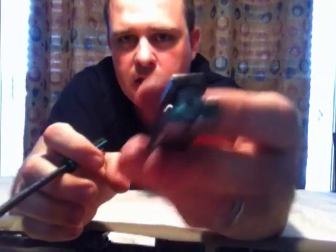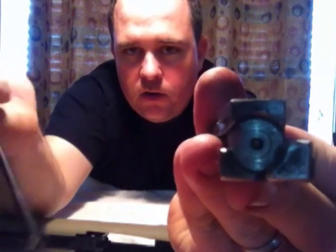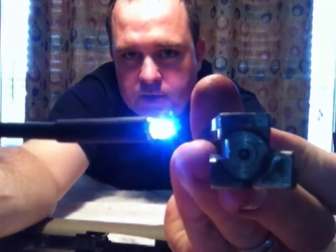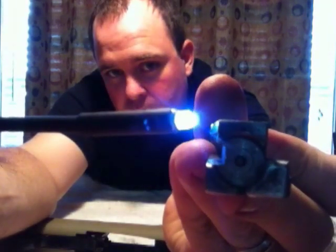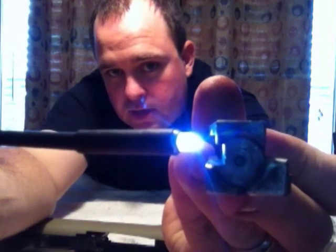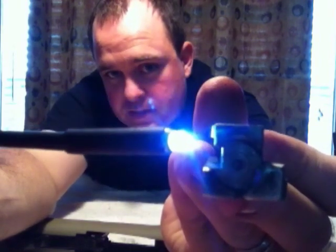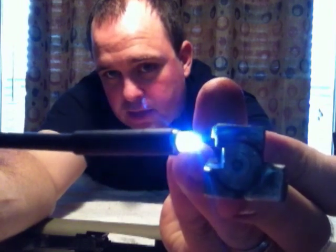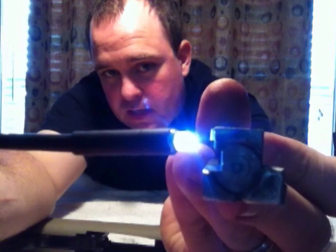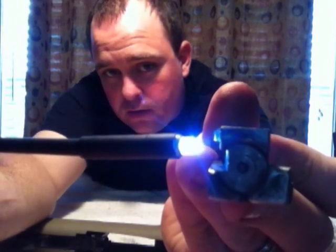But you can see on the front of the bolt here, right there, there's two ledges. There's the main ledge, or the ledge you can see falling to the bottom here, and the next ledge down, and there's actually three, and then it goes down one more ledge. Well, this second ledge, this middle ledge, if you will, is where you're grinding that to, and that's as far as it needs to go, to that second ledge, and no deeper.